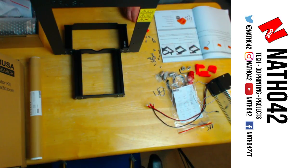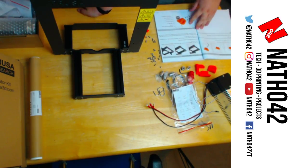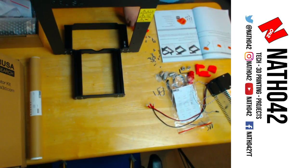There we go. All 4 are loaded. Loaded and prepped. Make sure you press the nuts all the way in. In case you can't press the nuts in, don't use excessive force. First check there isn't any obstructions in the nut trap. Nut trap, that's what they call it.